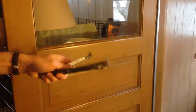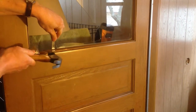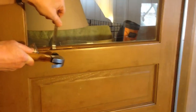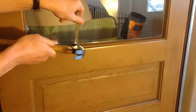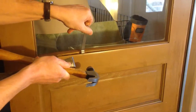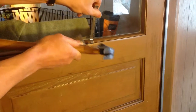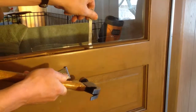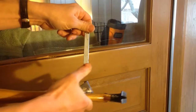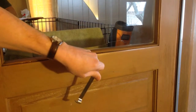I've got a set of several different sizes of pry bars and this is the smallest one here. I use that just to get a foothold in there with minimal damage. Tap that in there — you see it start to loosen up. Tap that in like that; you see the whole thing starting to loosen now. You don't want to rock it back too far because this narrow part will have a lot more force and start damaging the top, and you don't want to do that.